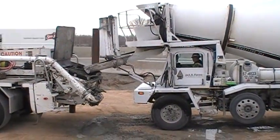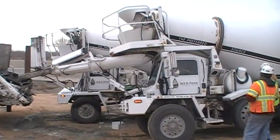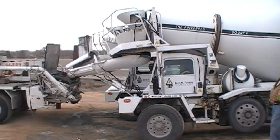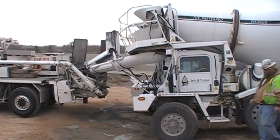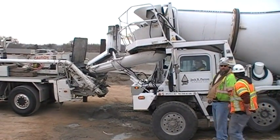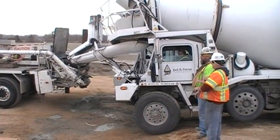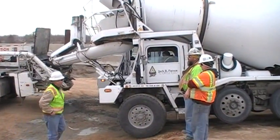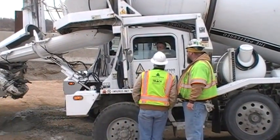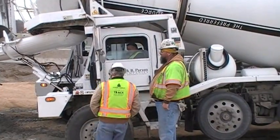Upon arrival of the concrete, the inspector should request a copy of the delivery ticket from the driver or the contractor's representative. Check the ticket for the mix being delivered, verifying the source, admixtures, quantity, and ingredient proportions. Pay specific attention to the amount of water added to the mix. Pumped concrete can be visually inspected as the mix is placed in the pump, but acceptance testing must be done at the point of placement, which is after it is pumped.